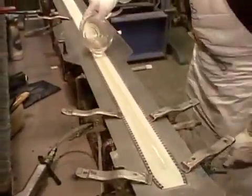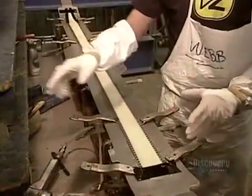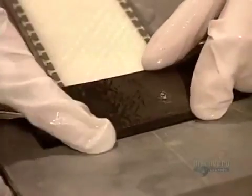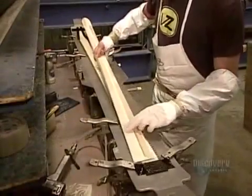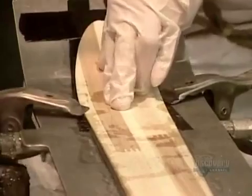This spray makes the adhesive dry faster so that they can apply the principal adhesive, epoxy. A rubber shock absorber goes on the back, followed by a durable plastic reinforcement called the heel piece protector. The ski's wooden core is made of aspen and birch laminated together.